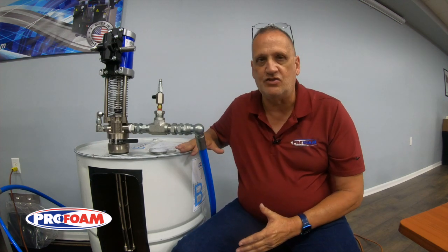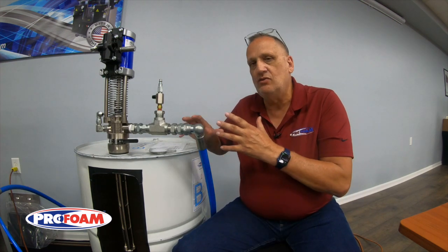In the old days, you might have been able to get away with moving your transfer pumps, spraying some out, and calling it good. That's really not the case anymore. With the chemicals we're using today, these resin sides really do not like each other. We want to have as little contact between one product resin and another product resin as we can — absolutely minimal contact — because they can actually, in some cases, gel up inside your system.